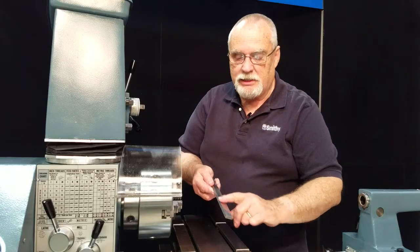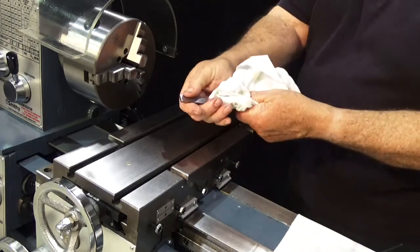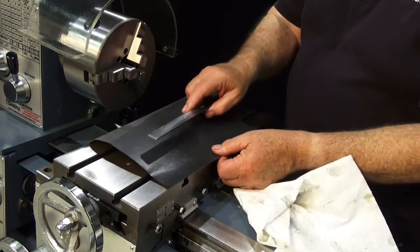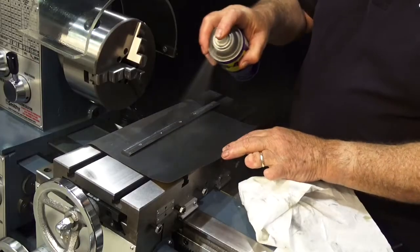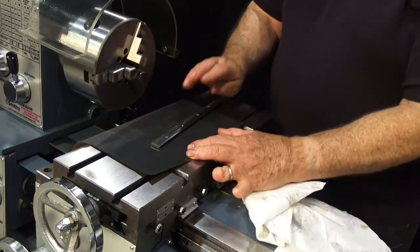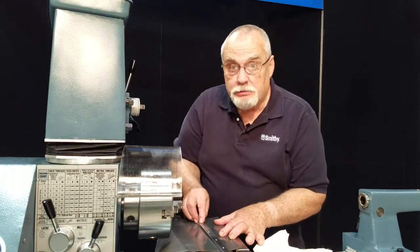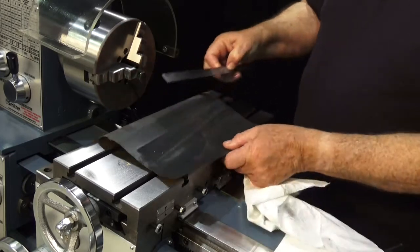This is the side that actually does the sliding — this is the side we're going to work on. If you cleaned this off and looked at it under a microscope, you'd see tiny peaks and valleys. What we're going to do is use a piece of 500 grit paper with a little WD-40 and remove the peaks, leaving the valleys so you have a place for the oil to flow. Just put your gib down here and give it just a little rub — not much. You're not trying to polish it, just trying to take off those little peaks, so you can get the gib tighter without it binding.